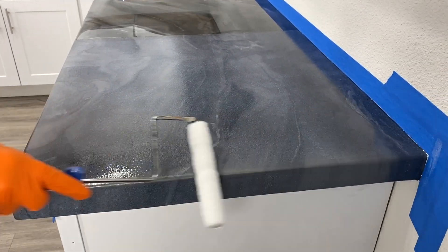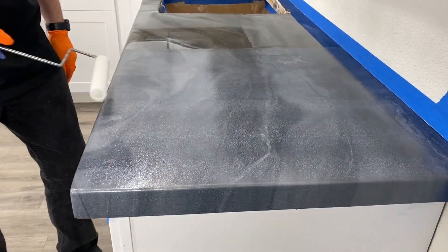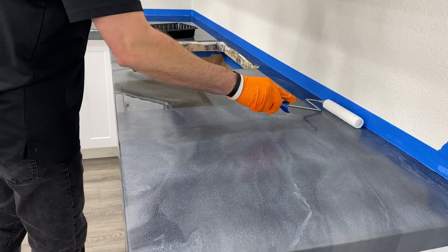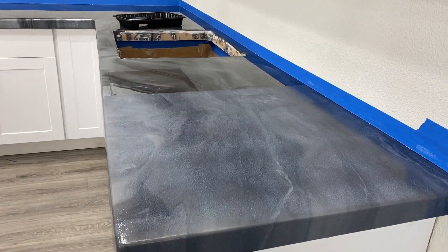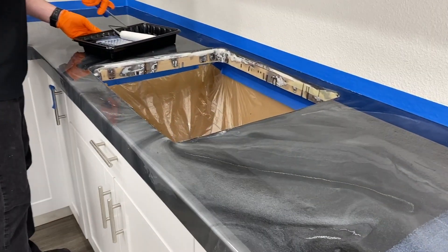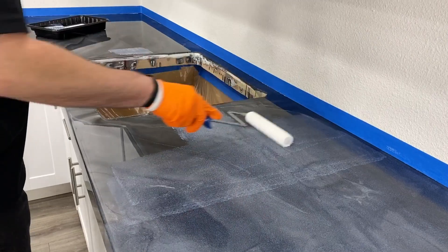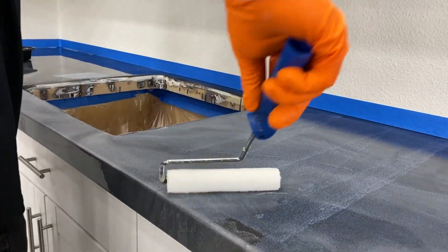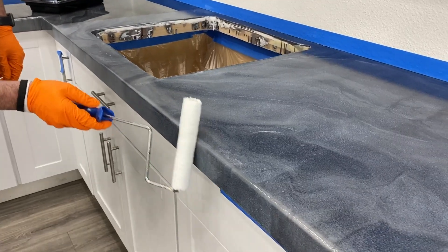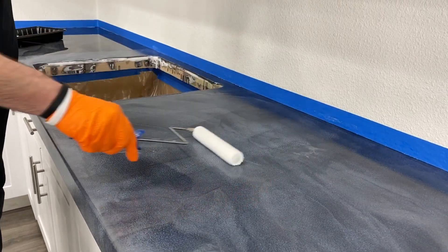Make sure you hit your top corners. Once you're done, I always like to roll on the top a little to even out the roller and get it flat again, then do a final back roll — not applying any pressure, just making sure there are no thick roller edges or lines. I always like to step back and look at different angles to check for thick spots or missed spots. Then re-dip and do about the same width again, always making sure you overlap a little into the previous section. Flatten that roller out after doing your faces, then back roll it.